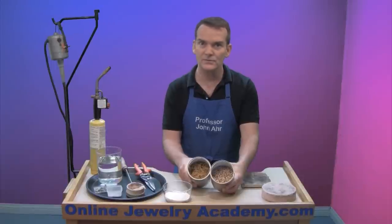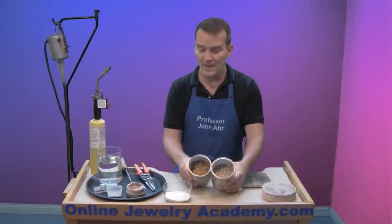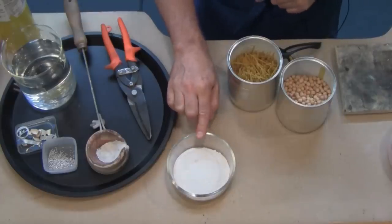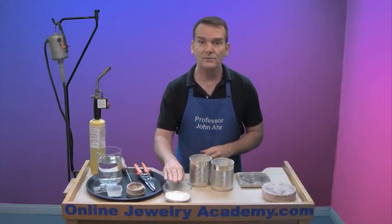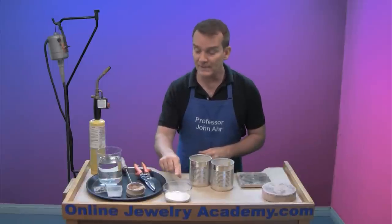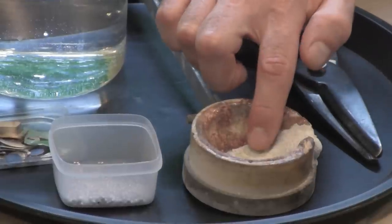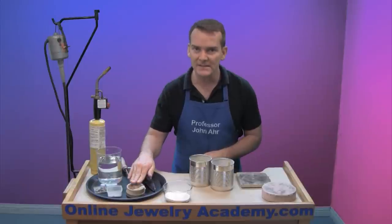You could use anything — pine needles, pinto beans — whatever you want, something that will give you an interesting texture and surface. Now, the magic for this project happens with this material. This is casting flux, which is basically borax. If you are on a strict budget, you can use a borax powdered soap. You're going to use this by the pinch in the crucible. The crucible is what they call seasoned with borax before you ever use it — this keeps the metal from sticking to the crucible.